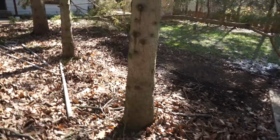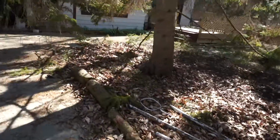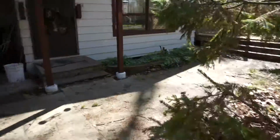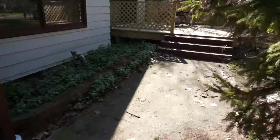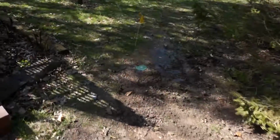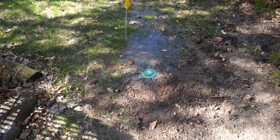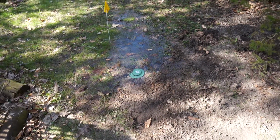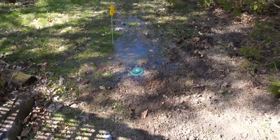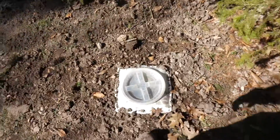You might be able to tell it's actually a little damp. There's quite a bit of water. So that's all been done, and unfortunately that also wasn't enough. As part of that plan D, I also installed this one overflow over here, and my plan was, well, if I'm still flooding the street, I'll flood my yard instead. This one's pretty close to the house, so that overflow and the 4-inch perforated pipe come out of here.